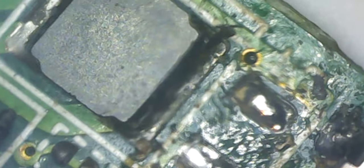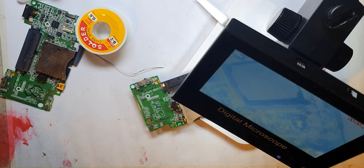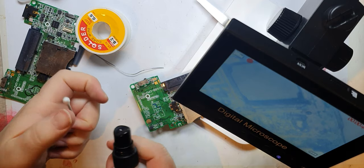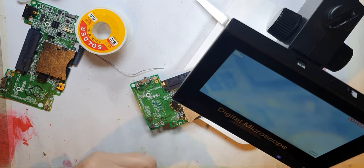Now if I'd taken this L2 off, what I would do first is just clean this area, because you see that is messy — it should look like a nice board. One of the ways you can do it is with a little bit of IPA. Everyone who does anything with retro stuff has some isopropyl alcohol and also Q-tips. I'll spray a bit of isopropyl on this and underneath the board as well, and just clean that area up.